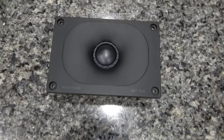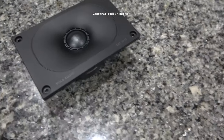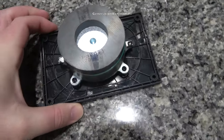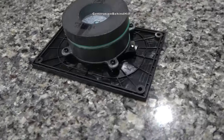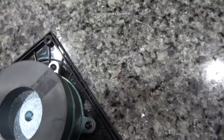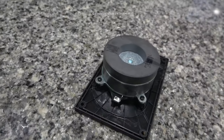In my opinion, the tweeter out of the XT20 is pretty average for this price point. Polk is using a pretty beefy motor structure that has a pretty good sized ferrite magnet plus an additional bucking magnet. The waveguide for the tweeter is made out of plastic and is about 3/16 of an inch thick. For comparison, the waveguide from the XT20 is just a tad thinner than the one I removed from my Sherwin Vega LA165, which came in at 1/4 inch thick.